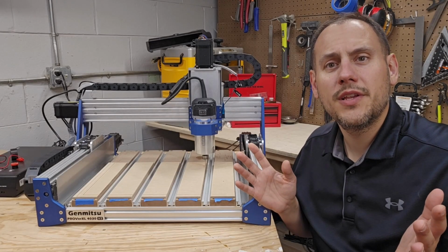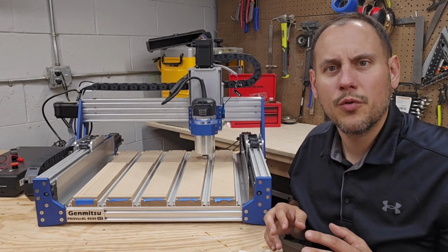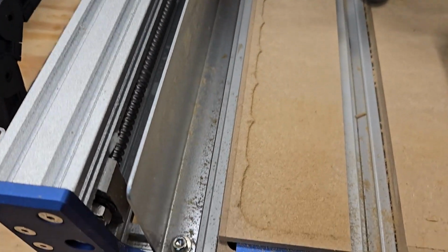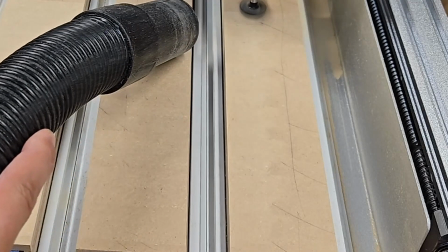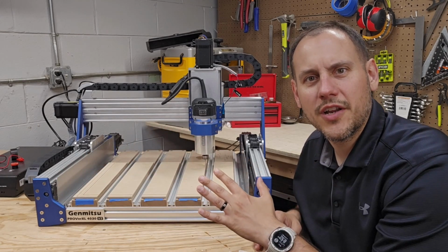The spoil board is complete. I did run into an issue though. I mentioned that the spoil board file would run the surfacing bit twice. Well, after the first pass of the file, I noticed that the x-axis min and max were not getting surfaced. That's because the spoil board at those extremes are outside of the machine's cutting area.